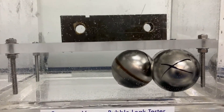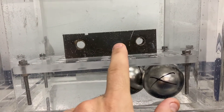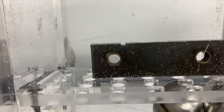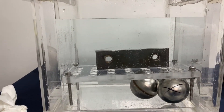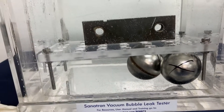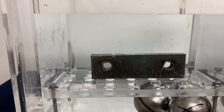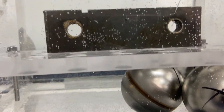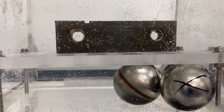What we've done is we've loaded three specimens here and we've turned this around. We're just using a counterweight to keep them submerged. On our real vacuum bubble leak testing system, this package restraining mesh is actually connected to this lid. We're going to pull a vacuum and let's see what happens. We're already seeing some bubble emission on this one — we are seeing bubble emission right there. So here's one leaker.